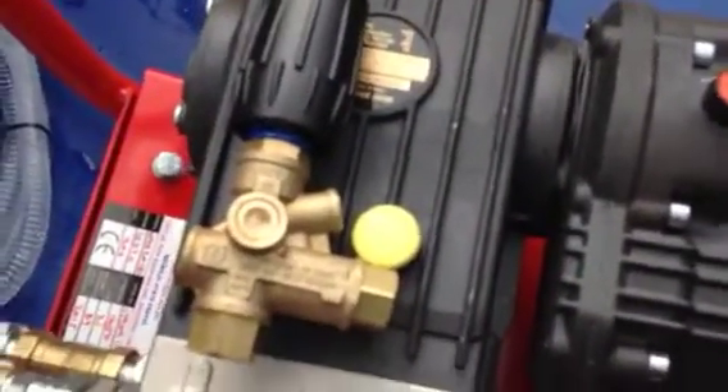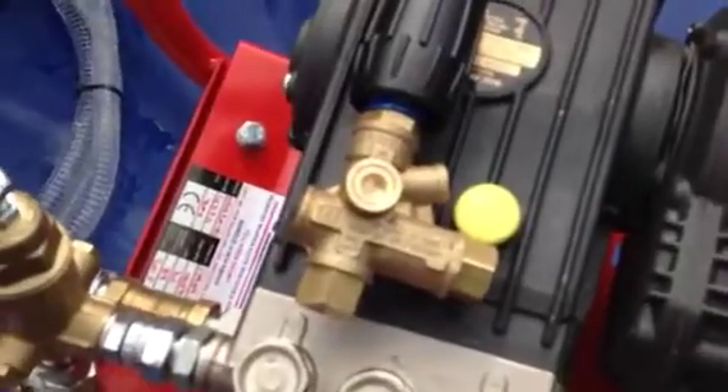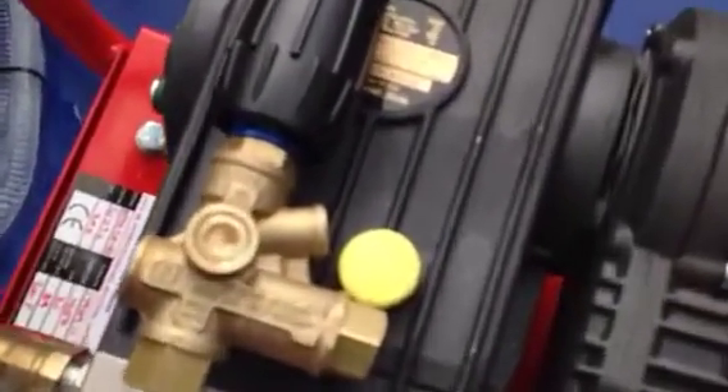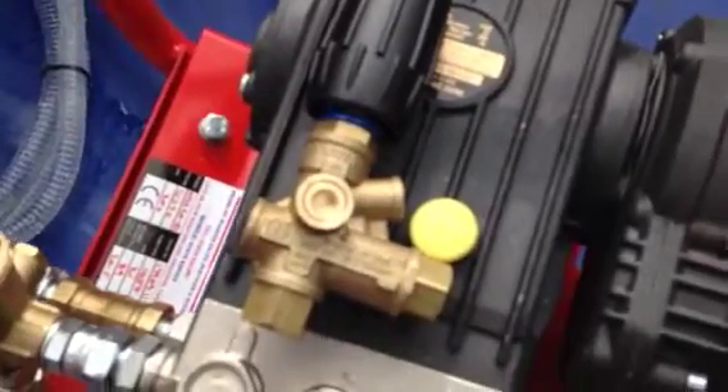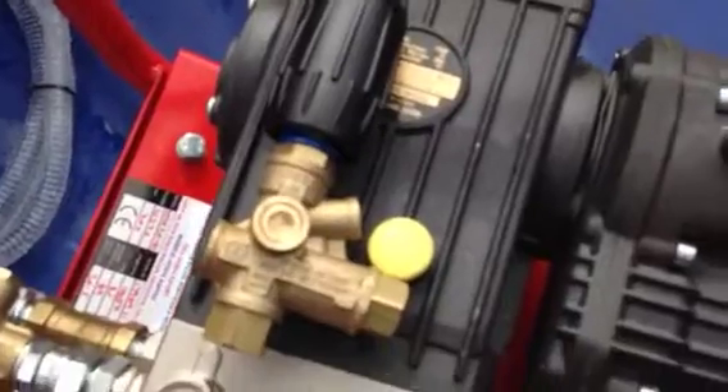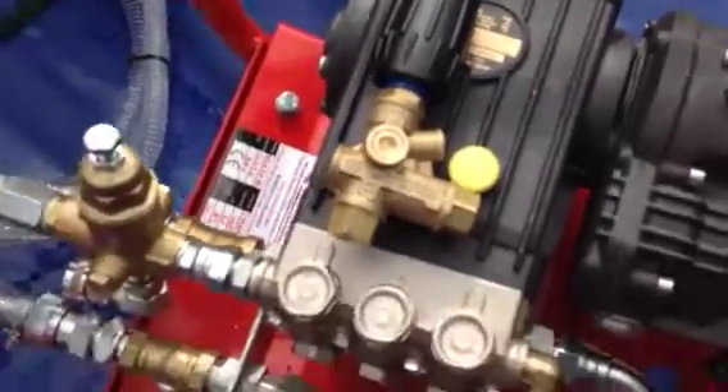Like a trapped unloader — they will both drop down. You will not maintain the pressure when you start lowering it down on the knob. On a trapped pressure unloader, you will lose pressure and litres at the same time as soon as you start turning that knob. That knob should not be touched. Regulate it by tightening the air and look after the machine that way.